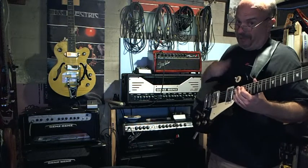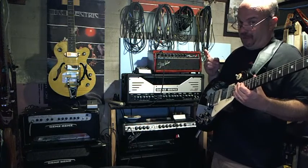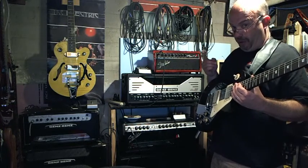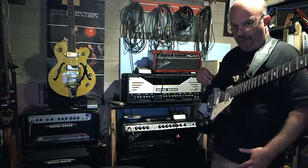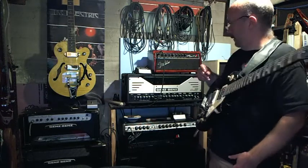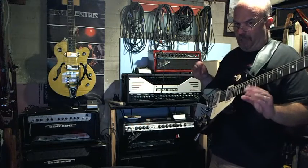I just biased the amp to 40 millivolts coming off of R20. Fender runs it a little cold, I should say, down at 20 millivolts or milliamps. It's a 1-ohm resistor, and so on. Electronic talk.